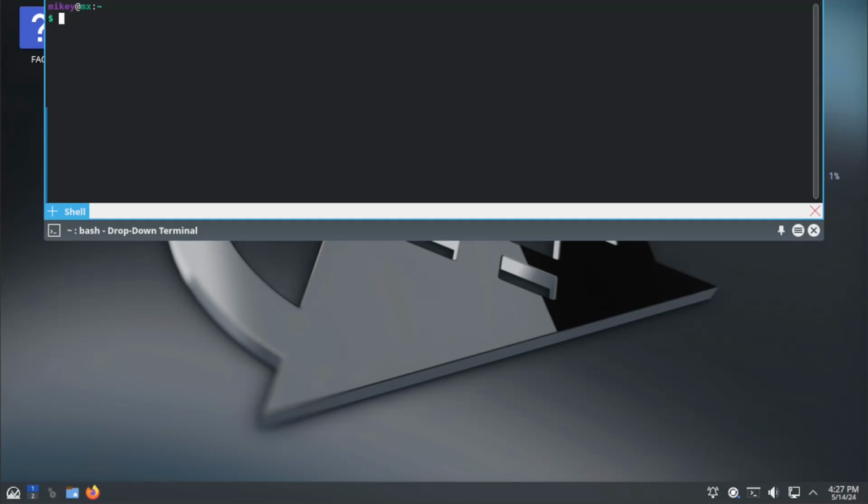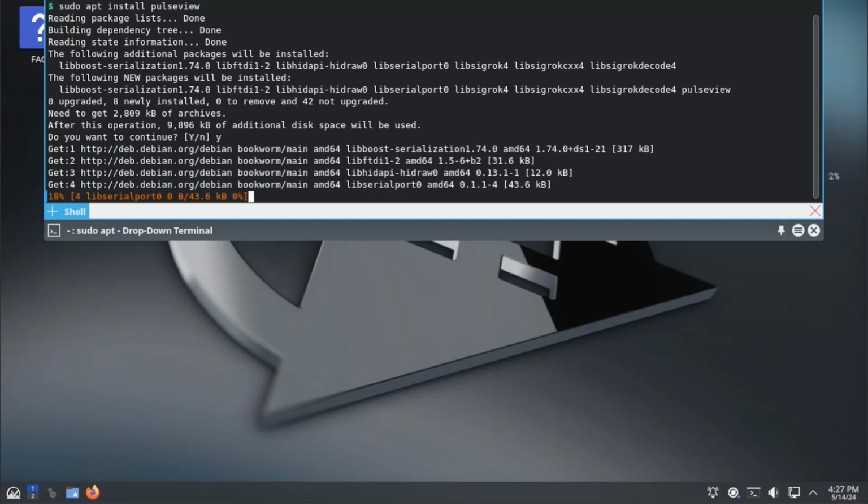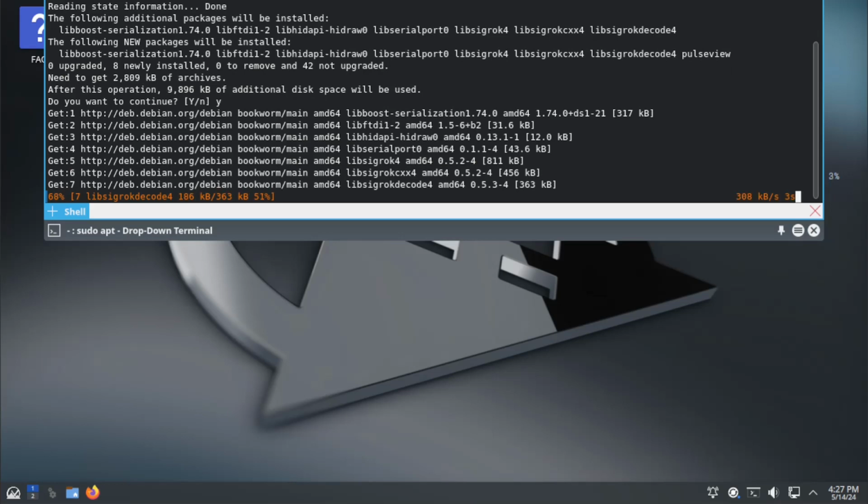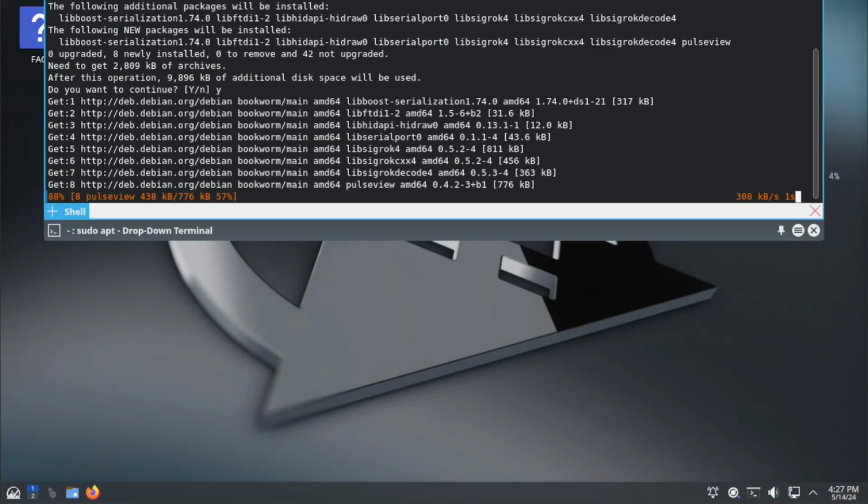First, I used Pulseview, and you can get that after you do your sudo apt update. And I'll include the shell commands in the description. I just use that apt package manager to install Pulseview because then it takes care of the udev rules and stuff like that. So that's sudo apt install Pulseview. This shouldn't take too long. Let me plug in my Logic Analyzer while I'm waiting on that.